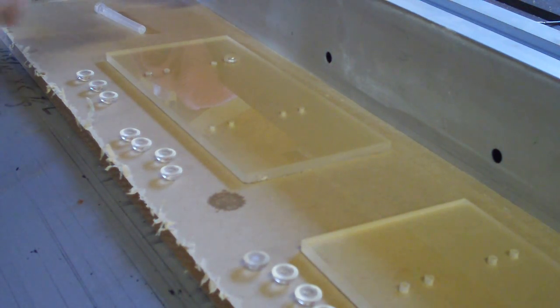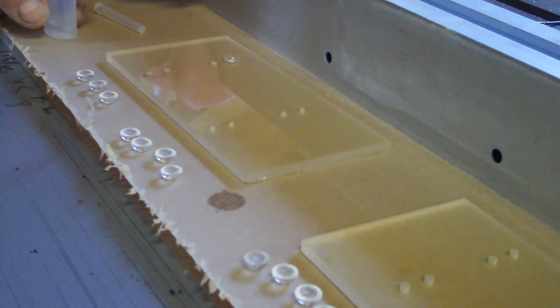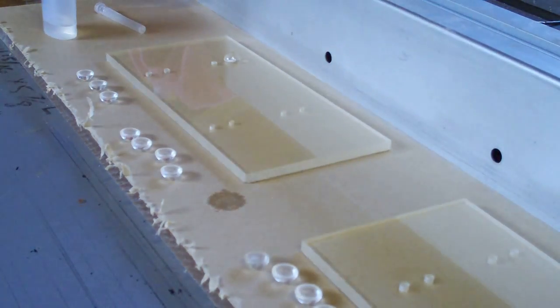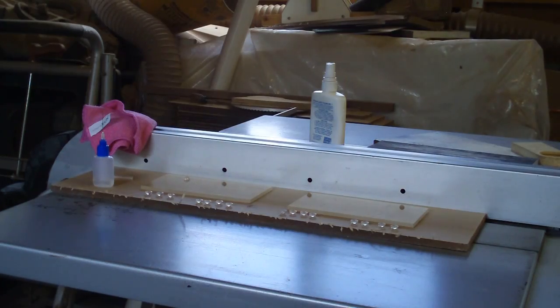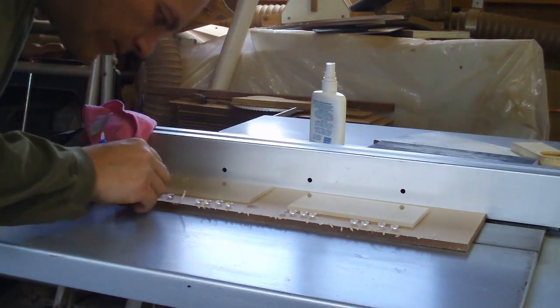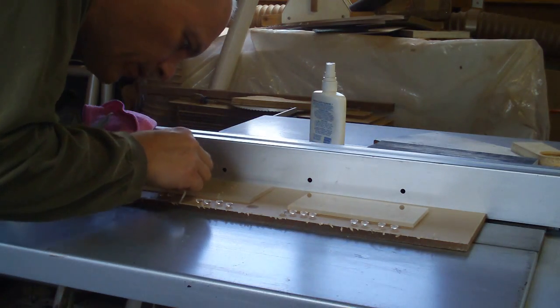And you'll notice I'm tipping the bottle so the big shoulder is here. So I get some fluid lined up, and then I just let it trickle, and I try and control it. But it wants to keep going because the temperature of my fingers is actually creating this boiling, because this stuff turns into a vapor almost at room temperature. So, line another one up.